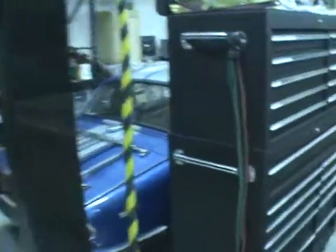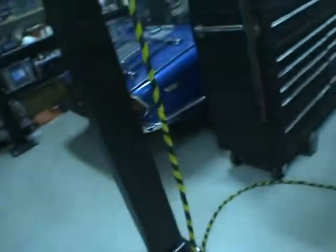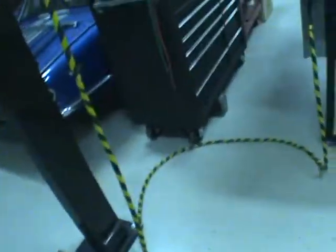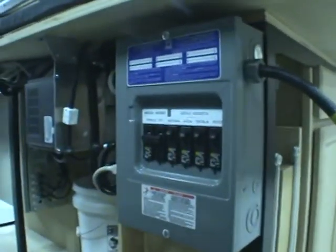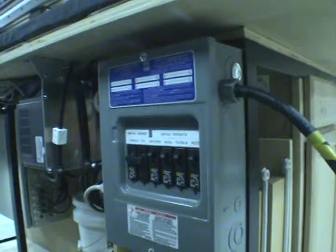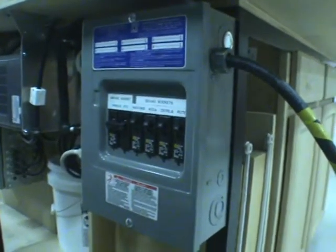I wasn't sure where I was going to put this table, so I didn't want a hard-wire drop from the ceiling - it's on the pole, yellow stripe. It's long enough so if I trip over it, it's not going to yank the plugs. Little overkill on the breakers - it's a 240 breaker for the VFD for the spindle; individual motors, switched accessories, the control box, and the computer all have their own smaller breakers.